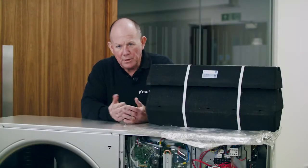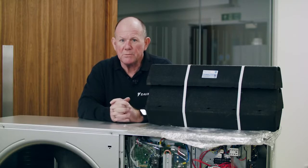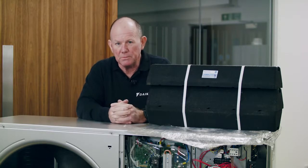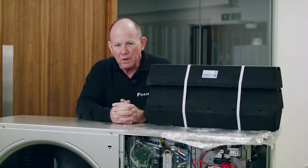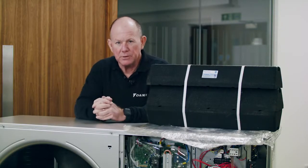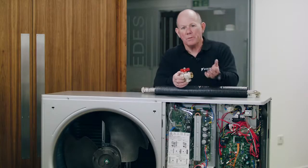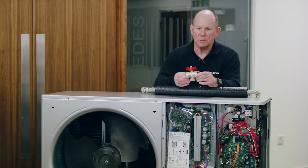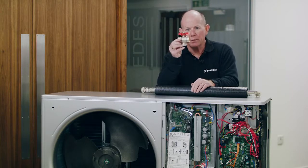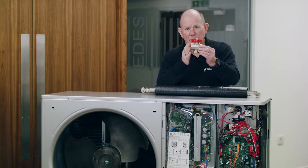It's important to ensure the unit is up off the floor — the minimum clearance beneath the unit is 150 millimeters, and the unit should always be sited at least 100 millimeters above the expected snowfall level for the area. Three anti-vibration feet are required, available in a pack of three; the feet are 150mm high, providing the minimum clearance as standard. The connections off the monoblock are all water — we supply a return valve and you field-supply a flow valve, which screw straight onto the inch BSP threads on the back.